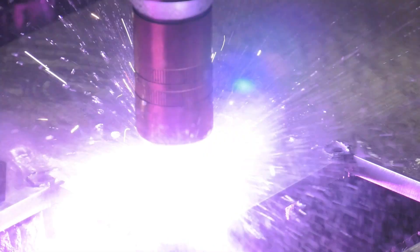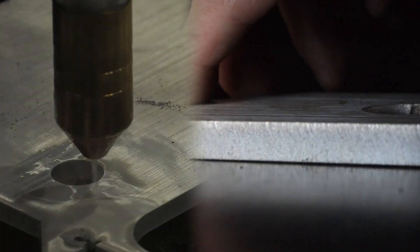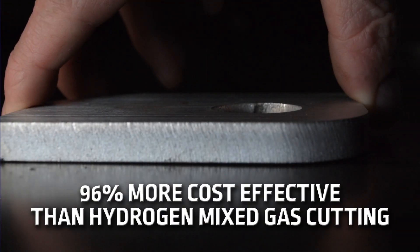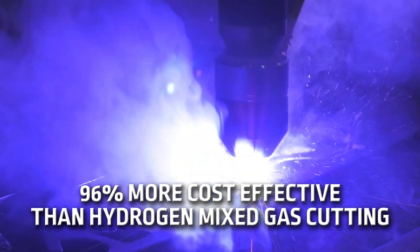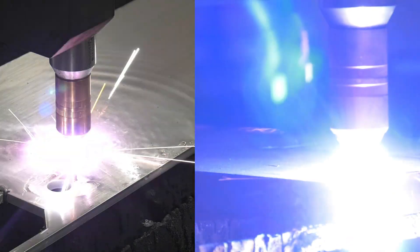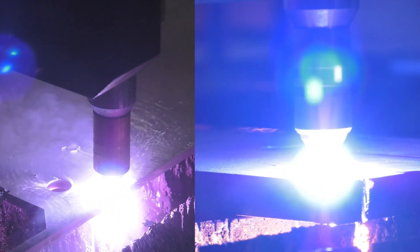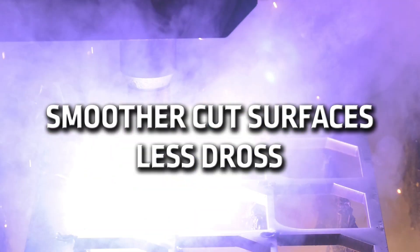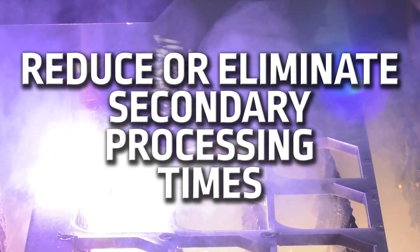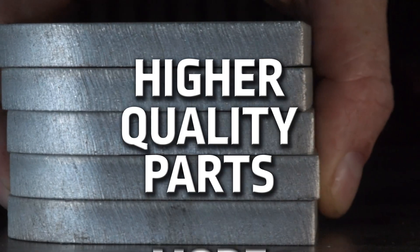Water injection technology offers a significant cut quality improvement over the base nitrogen mixed gas cutting process, and is 96% more cost effective than higher quality hydrogen mixed gas cutting. On both aluminum and stainless steel, you now have the ability to utilize regular tap water as an additional shielding gas from atmosphere. Smoother cut surfaces and less dross reduce or eliminate secondary processing times, making your non-ferrous part processing a more economical process, producing higher quality parts.